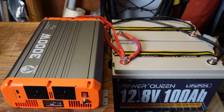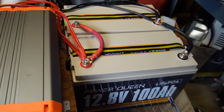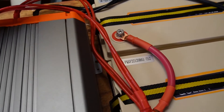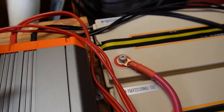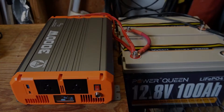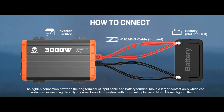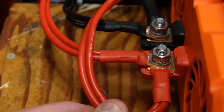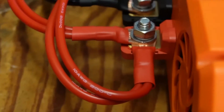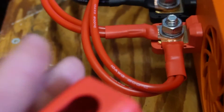Here's my testing setup: two identical batteries hooked up in parallel using the supplied Top Bull wires. In a real-world scenario, you'd want a fuse here, but I'm skipping it for this test. One design issue: when using two sets of wires as required, you have to orient them in a specific way to get good contact, and in that orientation you can't get the protective cap back on. A single large wire would be preferable, or wires designed to stack and exit through one hole cleanly.